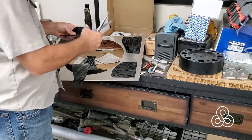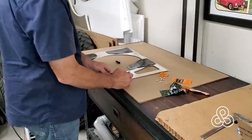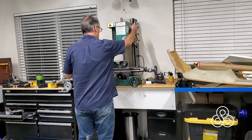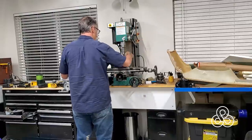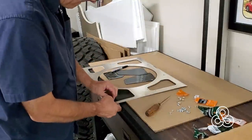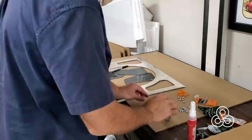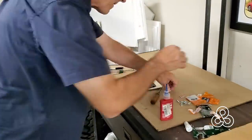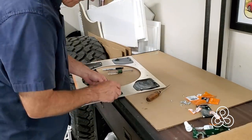It would have been nice if I could attach these on with some rivets, but the problem with rivets is they tend to just compress this rubber and kind of bunch it up. So I'm going to have to put them on with some small M5 screws. I've just marked it outside the perimeter of those holes, going to go over and punch those holes in with the drill press, come back and put those pieces of rubber in place, pierce it with an ice pick, and put the screws in to the backside. I'm using a big spread washer so that I don't compress that rubber.